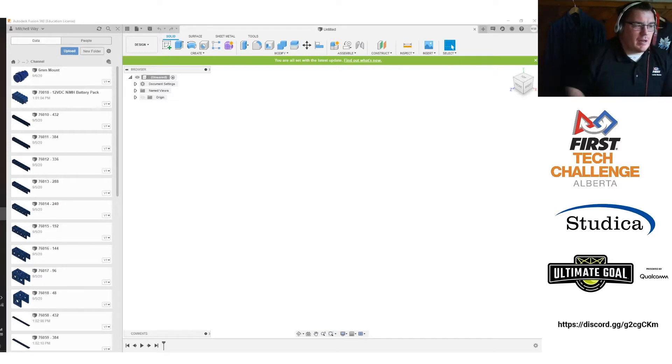What I'm going to do is actually CAD a basic bot chassis — just a drivetrain — something I might use for a regular FTC team using the Studica kit, laid out in Fusion 360. I'll talk about strategy, how to click and drag parts, and the basics of constraining them together. Then I'm going to turn the audio off, speed up the video so you can watch it happen quickly, and you can slow pieces down on YouTube by changing the speed settings.